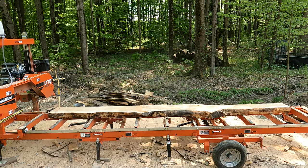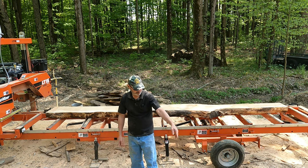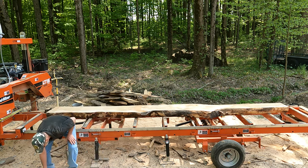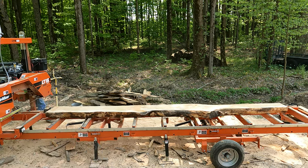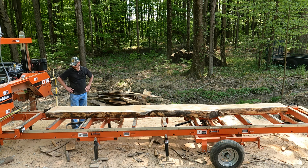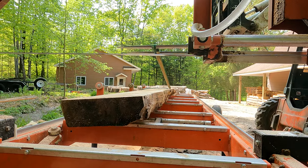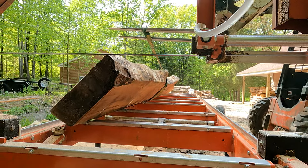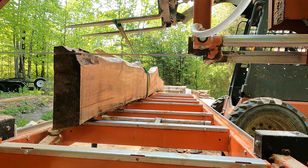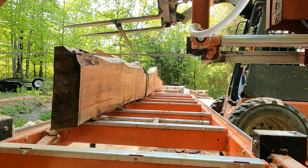They're sure pretty boards. I mean, I could just cut it there and there's a nice board, just edge it. Cut it there and there's another board. I don't know. It's not gonna work for a beam, so I'm hosed. You know what? I could turn it up on end and cut boards this way. Those might be pretty nice. And I might actually get a few before I hit the rot. Not half bad right there. We'll see.